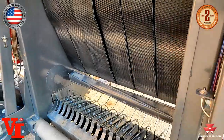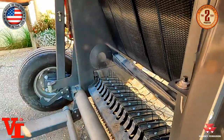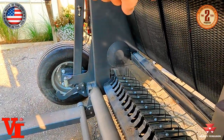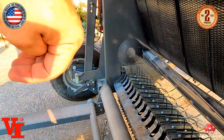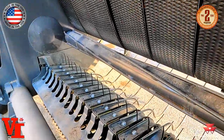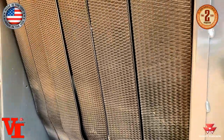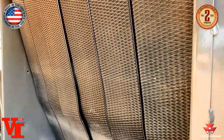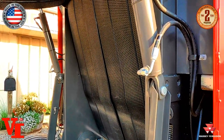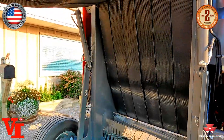It's the patented Hesston vertical bale chamber design. The hay comes in, these two belts are going to pinch down here at the bottom and create a tent cavity. The hay is going to come in, roll up — that starting roll is going to turn the hay as new hay comes in to fill your round bale and then it'll grow from there. You can see those wedge grip belts on the front. A lot of other manufacturers use this — if you're a green and yellow user, you use a Hesston bale chamber design in your baler.